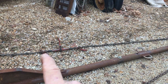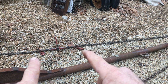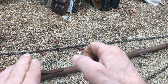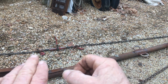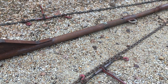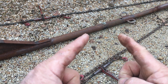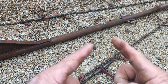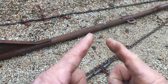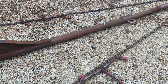those chains have to be longer than what that distance is, so that you can take a chain binder and just hook it at 2 points on the chain, and then just start ratcheting that binder in. Do the same thing on the other side over here, ratchet that binder in, and you can actually just watch that A-frame come under stress. You can actually just bend that A-frame and put it under stress, get it perfectly in the center, and I mean, it is just stout as can be with the addition of that.